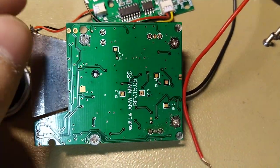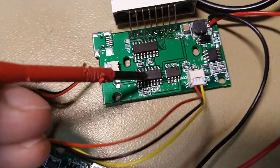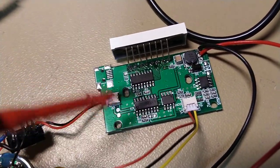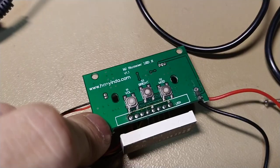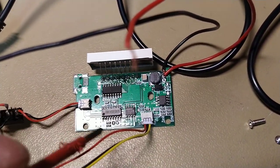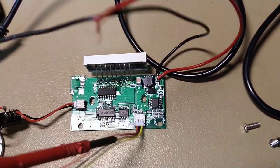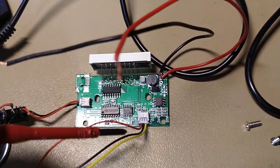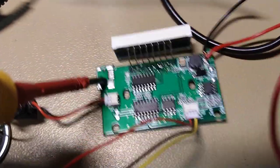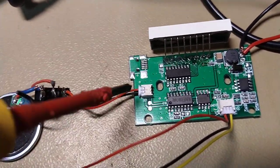which then detects stuff and talks to the sound recorder chip and the display driver chip on the display unit with the buttons, and tells it to display stuff and yell K-A band, and so on. And it all goes through this one wire, this single direction serial connection. Also, this one had a mini USB connector, and it was not connected anywhere. It was a purely cosmetic thing.